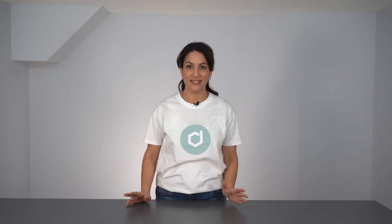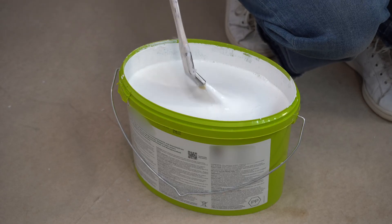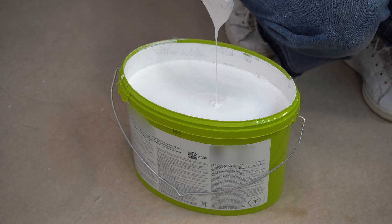After a resting time of 4 to 6 hours I can fill the wall and miter joints with the Decoflare glue. You can repeat these steps if you wish but you don't have to. Finally, the cornices have to be coated with diluted emulsion paint, preferably twice.